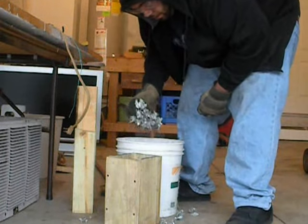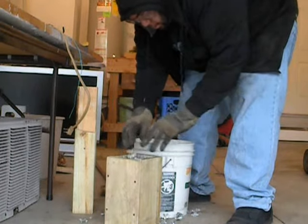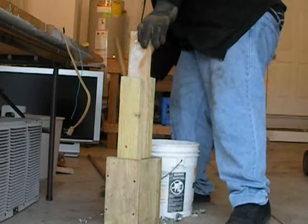As you can see, I have just a basic makeshift little compactor. You've got to have something to compact with — I've got this big piece of wood and another hollow piece of wood with no bottom so I can take everything out. The first thing is I'm going to put that on the ground. Make sure you have some other type of aluminum to put as your base so that all the little chips of aluminum stay in the bottom. Try to get as much as you can in there, just so you've got a nice compact brick of aluminum.